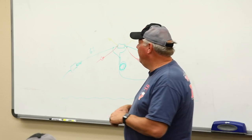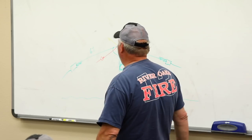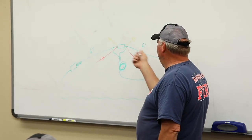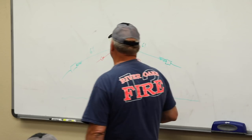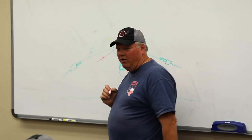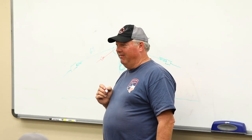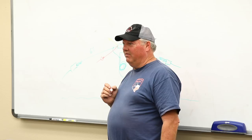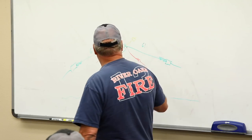As far as a tip, we'll talk about this later. But if you have a situation where you can't get 61 feet, and you only have 40 feet here, but you want an 80 meter antenna? Traps. Put some coils on it. Where did I put them? I almost gave it away. Where did I put the coil? In the middle, right in the middle of the way. Yep, you put it right here.